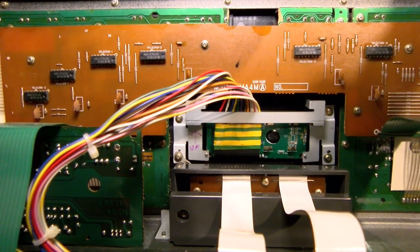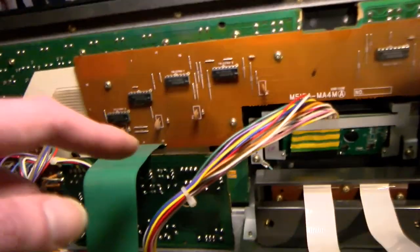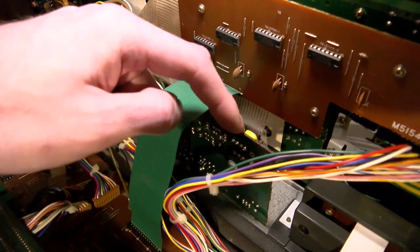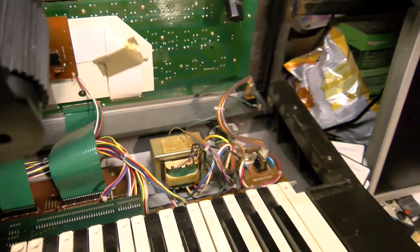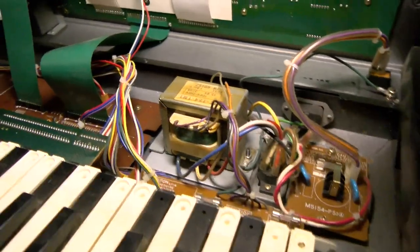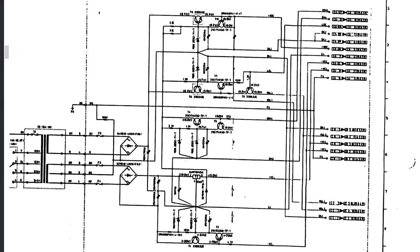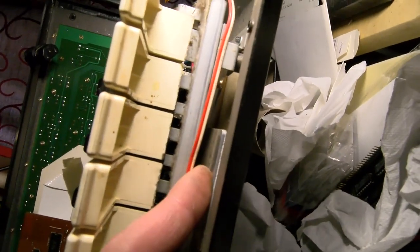As you're not using the EL driver anymore, it's probably worth taking this board off and cutting the little wire links to the flip-flop base supply. This will take some stress off the power transistor. The power supply in this instrument is linear. It uses Zener diodes to get a reference for a power transistor. It's not a very efficient setup, but it's a very old and simple setup that's tried and tested, and it generally just works with minimal fuss and doesn't make noise.